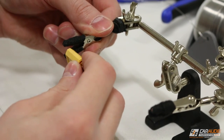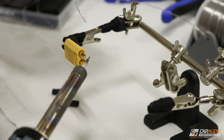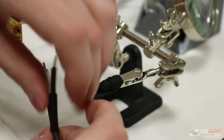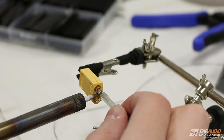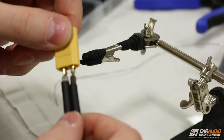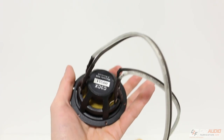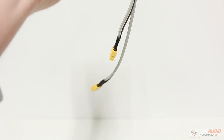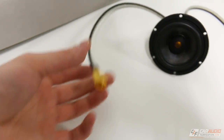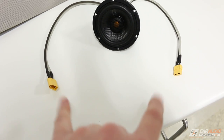To attach these connectors to the speaker wire, I start by tinning the connections on the connector — heating it up and applying some solder — then I tin the speaker wire the same way. Once I have solder on both, I heat up the bottom of the connector and attach the speaker wire. To finish and protect the connections I slide heat shrink over them and shrink them down. Now the speaker is completely connected to our connectors, with a female on the mid-range side and a male on the tweeter side, so there's no possibility of accidentally connecting the wrong signal wires.